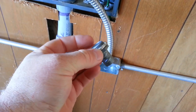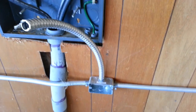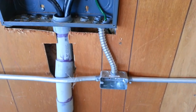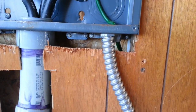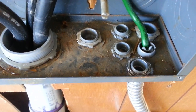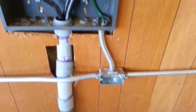This fitting screws into the other piece of conduit and then up into the box. So we got the flex conduit in — screwed in here and up there. It's such a short run it didn't want to bend very well, so I had to fiddle with it, but it's tight. We're ready to do the wiring portion.